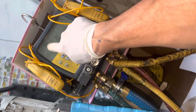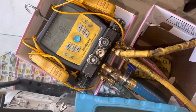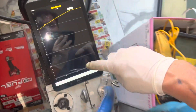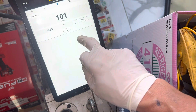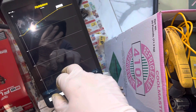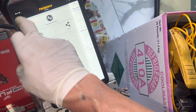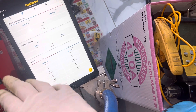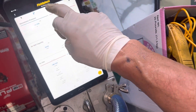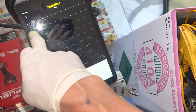Let's open up the vacuum and watch it pull back down before we open it up to the tank. Let's recapture since we lost contact — there it goes, it caught on again. Let's start over and take a fresh graph. We'll go to measurements under microns — right now this is temperature and pressures, so let's go to microns. We're at 76. Let's graph it and start fresh. Now we have a new graph and you can see it slowly starting to go down.